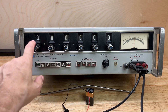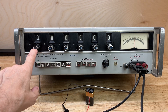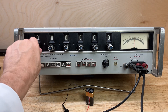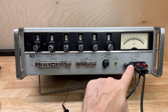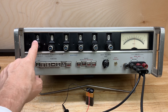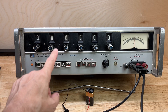The resolution or sensitivity of the meter is selected by pushing these blue buttons at the ends of the dials. When the times-one button is selected, the meter sensitivity is in terms of one volt on the 10-volt range — each click moves the meter by one, positive or negative. The meter reads a little bit higher than one, which means it's a little bit higher than nine volts — about 0.4 higher. So when we switch to times-10 we'll have to set this to about 4, to read 9.4 volts.